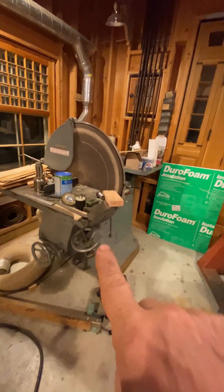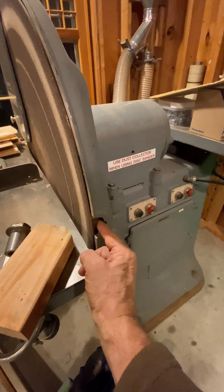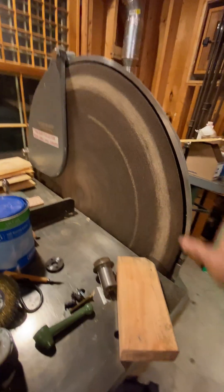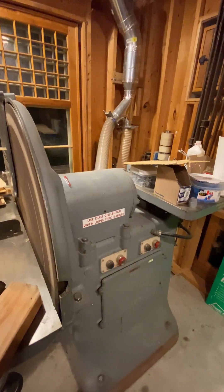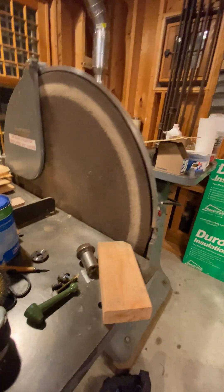This machine is considerably a hard start. It's a big cast iron disc and a very slow speed motor — a four horsepower motor with a lot of poles. I think it's an 800 RPM motor.